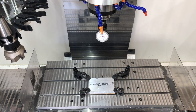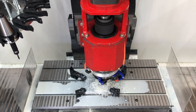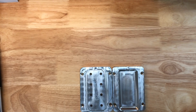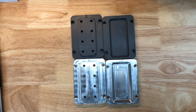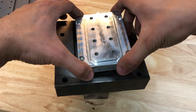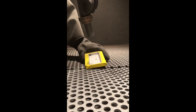Next we had to make some random test molds. Injection molds take a very long time to design properly, so I opted to create a quick and lower quality aluminum mold from an older project of mine — these are casings for specific electronic PCBs. I also 3D printed some molds, and while I knew they would not survive the mixture of high temperature and pressure, I figured it was worth a try. We then did a quick ejection pin test to make sure our mold pieces were lining up properly. The die springs in these molds are very stiff so I could only press the molds in momentarily.